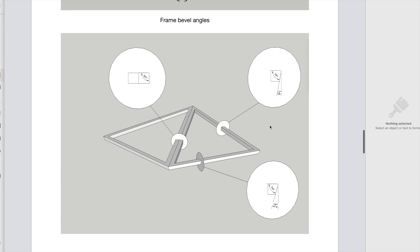You've got your bevel measurements here. The bevels are different — there's a 16-degree bevel on this edge, the centre one is straight, and this one is an 11-degree cut. So there are two bevels. This is the shortest length of timber and this is the second longest piece of timber.